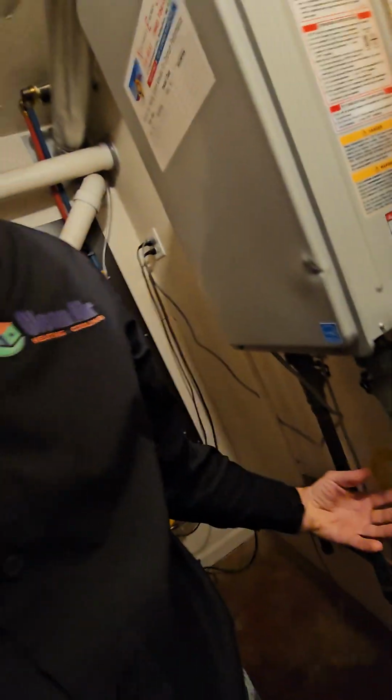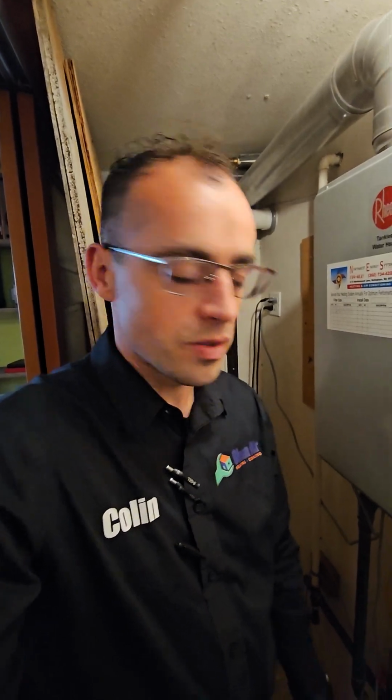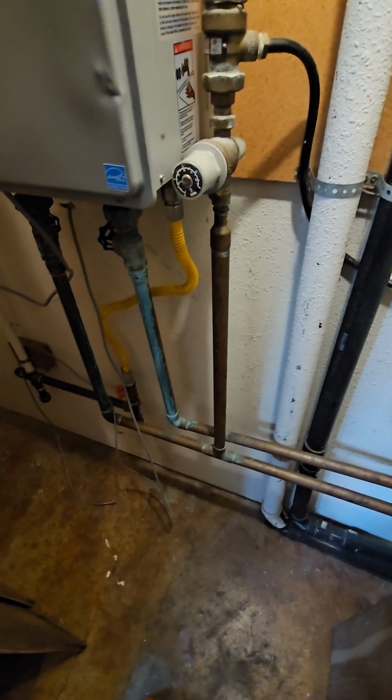So right now it's October and it's 60 to 65 degrees outside. You just need probably 80-degree water. And because the floor is a huge mass in the slab, you just want to have just enough heat to keep the house comfortable at 70 degrees. But then if it gets colder outside, that floor temperature may have to go up to 90 or 100 or 105. And so in our area here in Bellingham, worst case scenario is going to be maybe 5 degrees outdoor temperature, and a slab that's 100 or 105 usually can do just fine, but you never want to go past like 120 or 125. Anyway, so the old system doesn't have that feature, so it's probably hard on the floors, with a lot of expansion and contraction, and it's just not efficient.